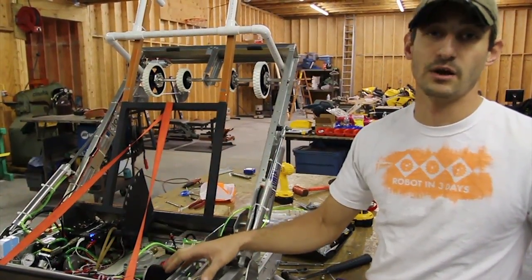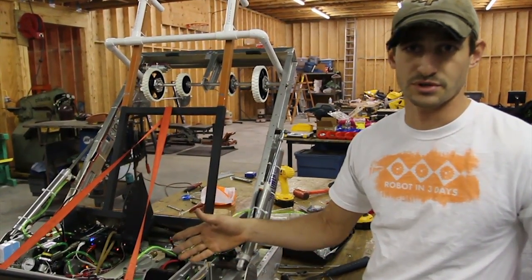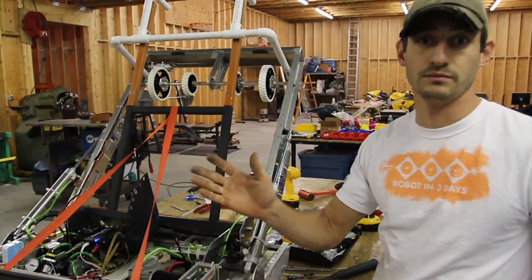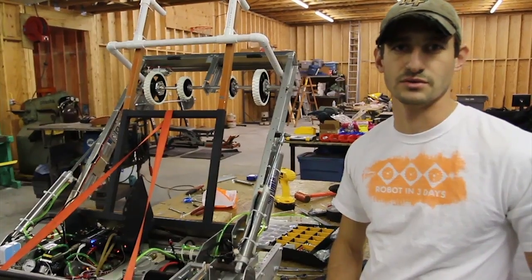It has plenty of power to pull it down, but when you're just sitting there holding that amount of force, it's too much amperage — current draw on the motor — and we fried one. So that ratchet mechanism allows us to just take the power away from the motor, and the winch stays there holding the tension in the surgical tubing.